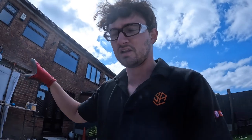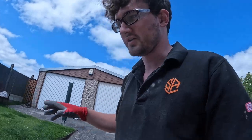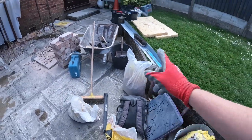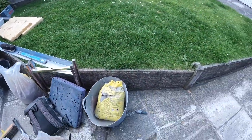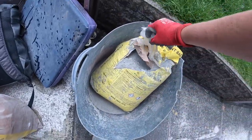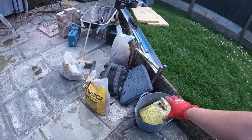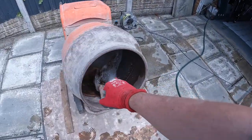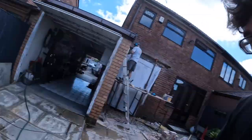This is a 2100 lintel. We're going to need about a third of a mix. So the way that works for us is one big bag of Fairwood sand, because the big ones are 40 kilogram bags, plus a tiny bit more, and probably half of that bag, since as you can see this is kind of demolished and a lot of the cement's gone, so half of that, which will make it up to a third-ish, and then that sand we add feb in for easy mixability and better use. That's why we use feb.